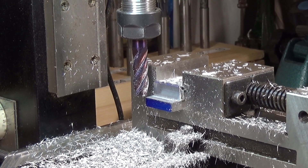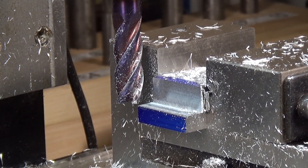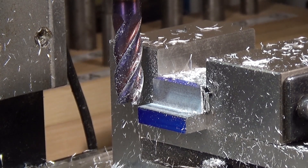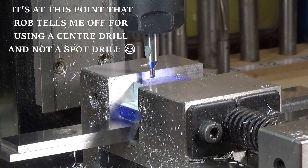Right, we're there. Now I've still got to drill a hole in it and tap it 6mm for the stud that goes through — that's the clamping — and then it will have to be cut off and cleaned up. That's the next couple of operations. I've clamped the two parts together, the original top part and my new bottom part, and I used a transfer punch to mark the position of the hole. I've now swapped out the 10mm end mill for a centre drill. I'm going to centre drill the hole first and then go through with a 5mm twist drill, which will be the tapping size for 6mm. So here we go.